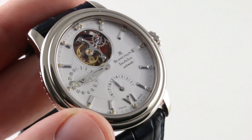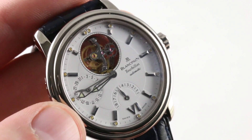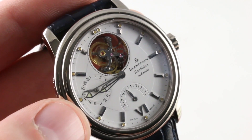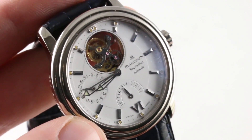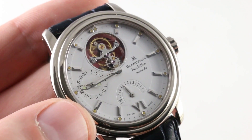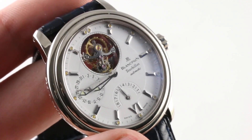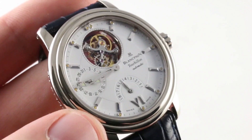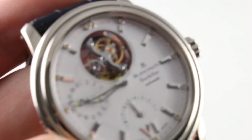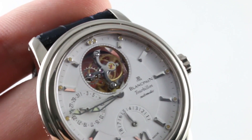Each of the applied white gold cups bearing the original luminova material have aged to a glorious ecru coloration. The dial base is a matte white and features black-on-white print to ensure optimum legibility. It has skeletonized minute and hour hands to allow universal visibility of the dial displays as well as the tourbillon regulator itself. Radial date at nine o'clock, eight-day power reserve scale at six — all of the indices are hand-applied, diamond-polished, and white gold to match the white gold hands.